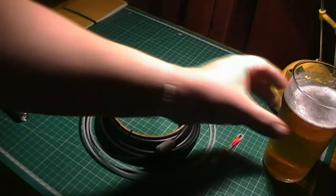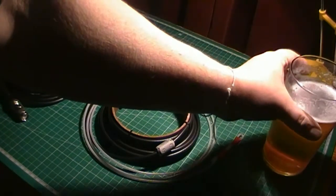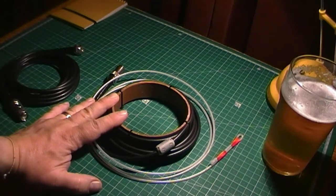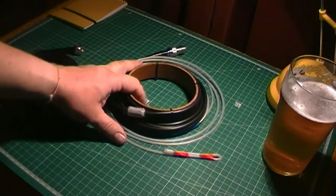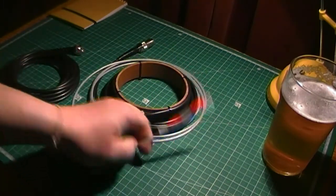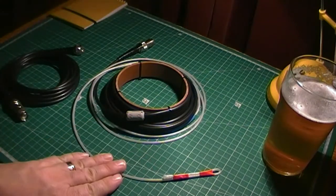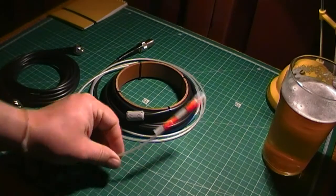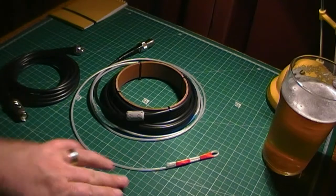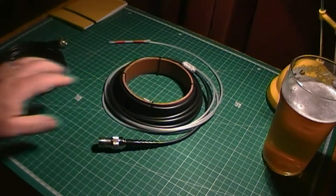The brew's been substituted for a beer — we're now into the evening, it's been a long week. Just a quick snippet of video to reiterate a couple of points that I didn't probably cover in the tuning video. One thing I didn't do — I didn't show it packed down. That's it — that's how much I had to bend over from the 106 inches. That's about 102 inches all told. So it was an extremely easy bit of tuning. Not everyone's going to find that's going to be the case, because obviously there's variation in surroundings, coax quality, or whatever. But that's what I did — 102 inches — and it needed no further adjustment.